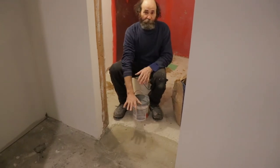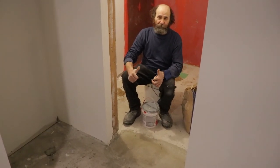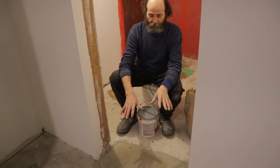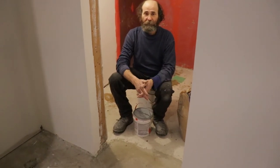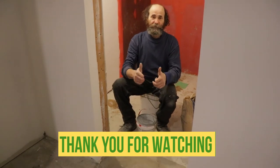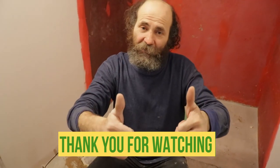For the top layer I use building sand, Portland cement - about one part cement and three parts sand. Just make it right with the trowel. So to summarize this repair: we did one layer with an aqua cement water seal, then one coat of red guard, then the top layer with Portland cement. Make sure it dries between the layers. This worked very good - like I said, done this in the past and it's 100% moisture tight. And my friends, thank you for your help, thank you for your support, I love you guys, thank you for subscribing - see you soon!